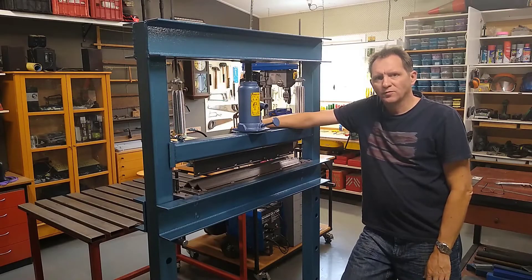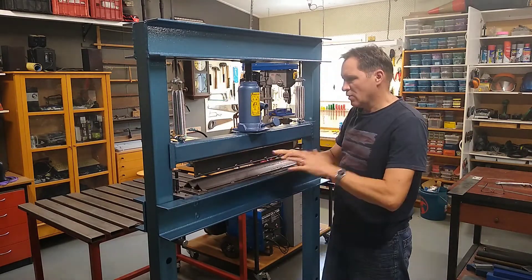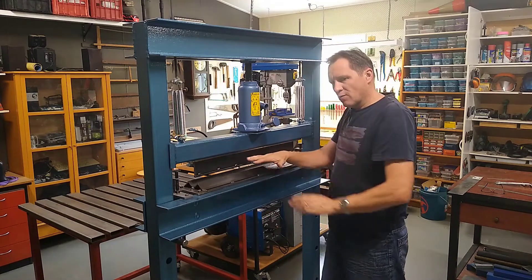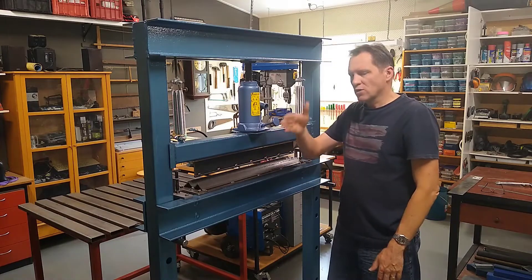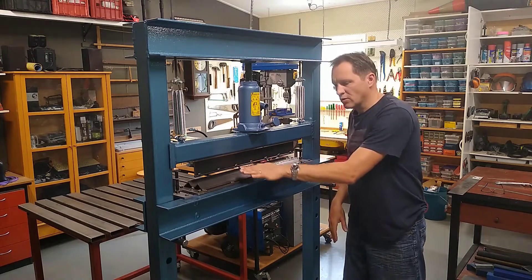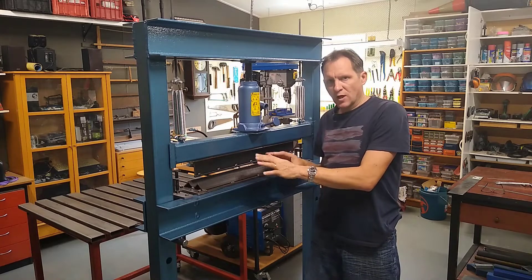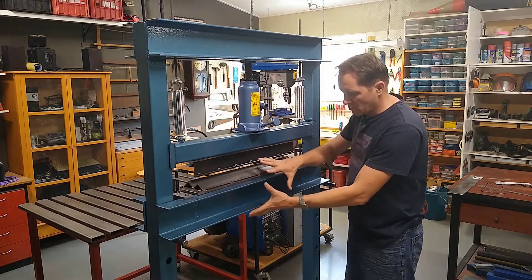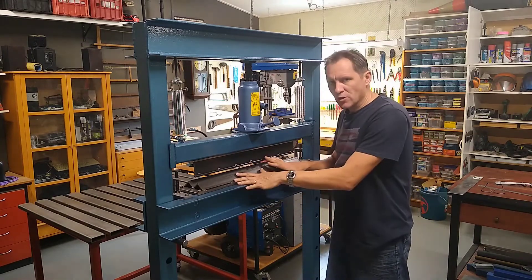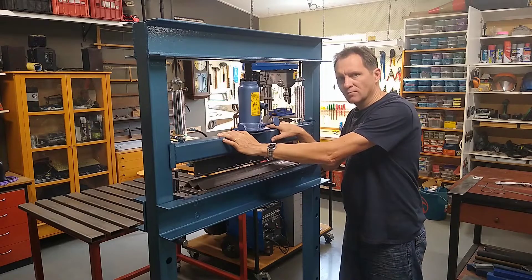Hello and welcome to my channel. In this video I'm going to make some tooling for my press brake in order to bend smaller radius. As it stands now, if I form a circular shape on this press brake, in a lot of cases I've got to try and make the fold go downwards to clear the jack. The minimum size of the diameter that I'm able to fold is determined by the bulk of this. So I've got to make something to get the punch and the die away from this. I've got something in mind — let's see how we go.